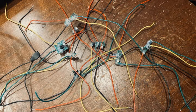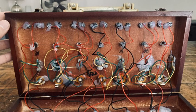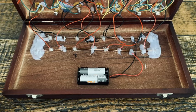I picked a few and simply wired them to be triggered from an external or internal switch. Some are wired to cut power to make a short trigger, and some are wired to the original button for the longest sound sample. I replaced the buzzer speaker with quarter-inch jacks for audio out and powered all of the keychains with a few AA batteries.